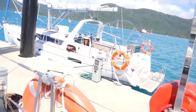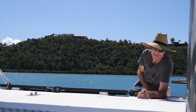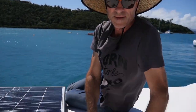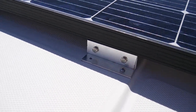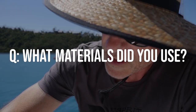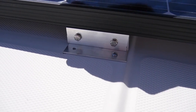Dad's just been building the frame for the solar panels. He's cut up all the pieces he needs and he's putting a bracket on the roof at the moment. He's putting on solar panels using brackets with bolts and aluminium angle so he can adjust them and also take the panels off easily. This was 3mm aluminium angle and he had to cut each bracket, drill the holes, make the brackets up, and then fit them to the panels and then to the roof.